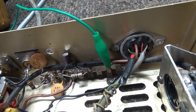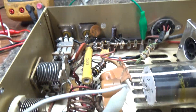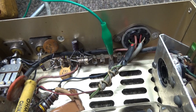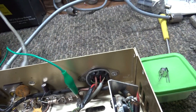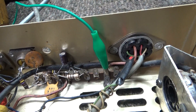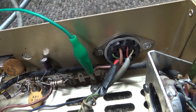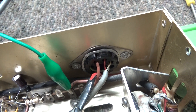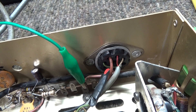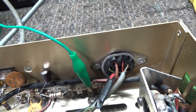Don't do this at home. What I'm doing right now is I only have low voltage — a 13-volt power supply — going to this RF deck. There is no high voltage or high voltage power supply connected to this amp. I just have a low voltage power supply connected to the low voltage circuitry so I can stick my fingers in there and explain things without worrying about getting shocked. Don't do this at home with high voltage.